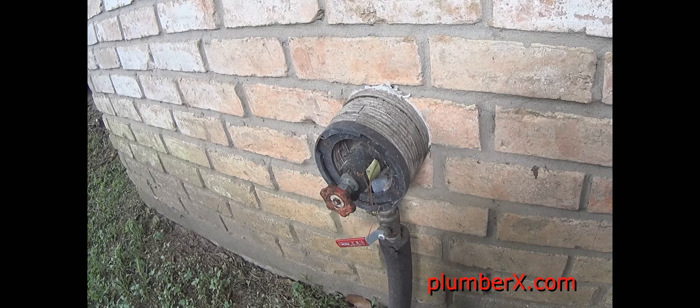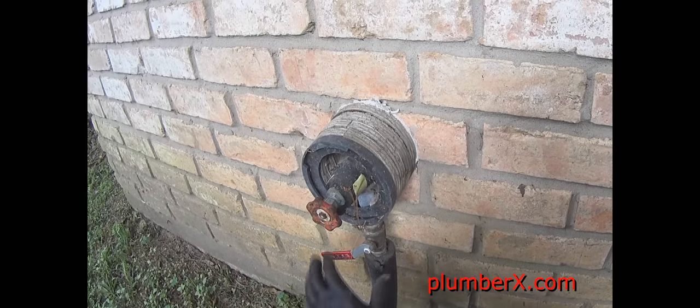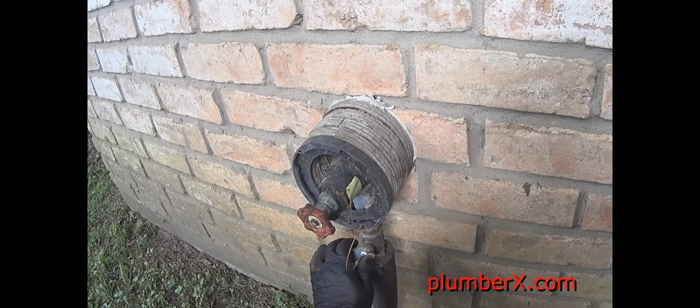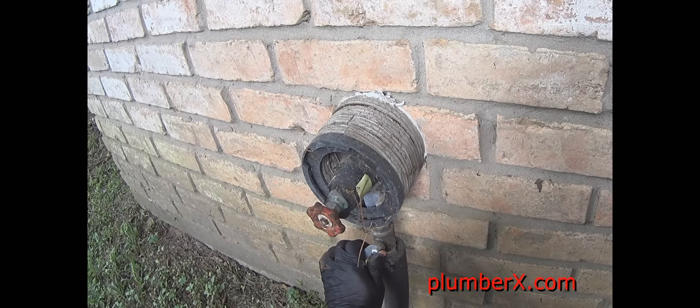And what I've done before I even did this is I went to another tub in this house at the farther end and opened the water there, so that the pressure coming into the house would go straight through the system and out through the far side of the house, clearing all the lines so that you won't have any stoppages on any of the other sinks when the calcium and stuff comes through and starts to clog up your aerators. And that's not blood, that's just a little rust from pulling the stems out.